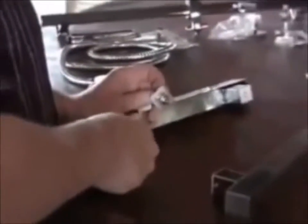For the handles, it's an Allen key — there are four per each and you get an Allen key with it, so we loosen them off. Then you're going to have this fitting — loosen this fitting off right here, and take those off on both sides with a Phillips screw. Get that moderately set, snug that up. This side is going to set right over top, and slowly get that set screw back in there and run through all four of them until we have this securely mounted.